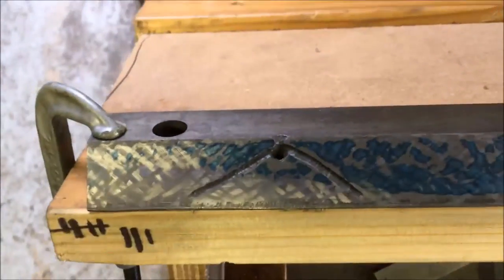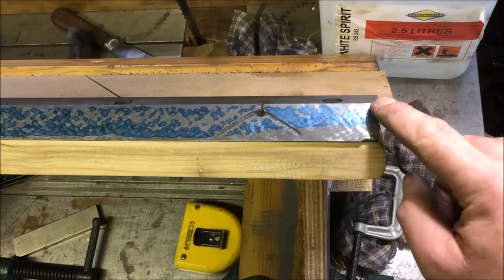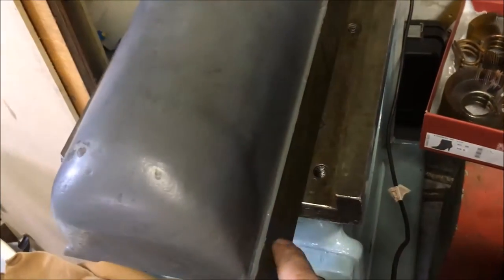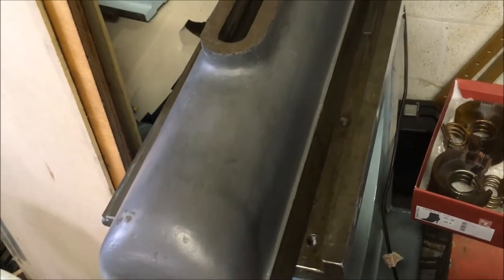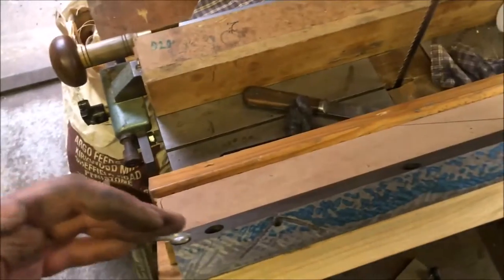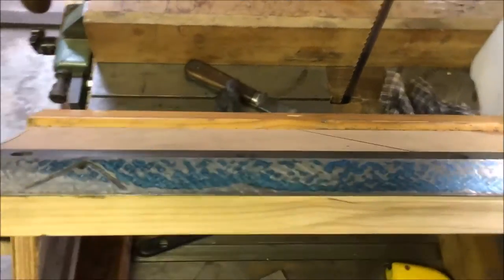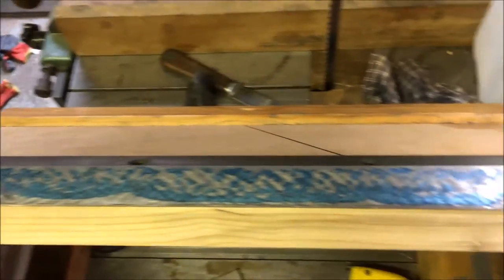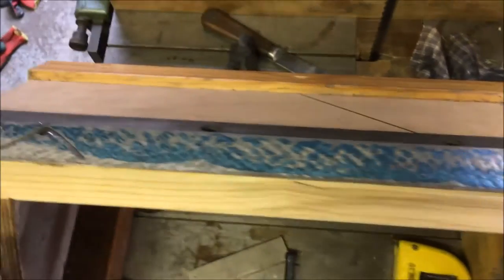Still heavy inking. I can only go so far because the angle between that face and the mounting face is obviously determined by the gib, which I haven't scraped yet, and the gib has to fit that. I'm only really cleaning the gib up - ultimately I expect to probably just adjust the angle on it to get an equivalent fit. I'm just trying to get out any twist and significant wear in it. I'll probably do another ten cycles and then call it done.